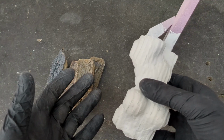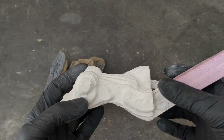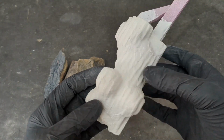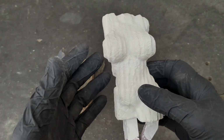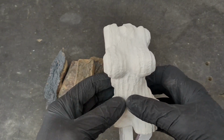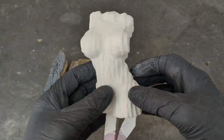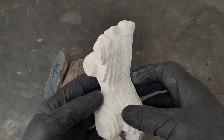And it has happened to me before. I just did it in a copper melt recently. You'll see that, I think, after this video, probably. We'll see. But with only one layer of plaster, it's just not enough to retain the heavy metal into the foam here, into the mold. So I tried it. We're going to see how it works.